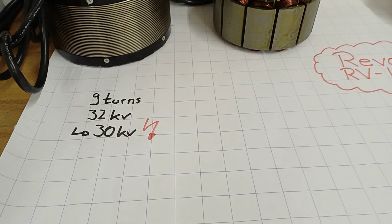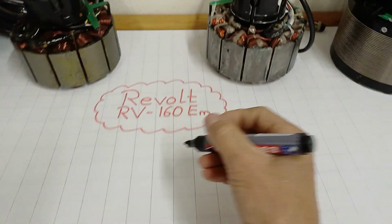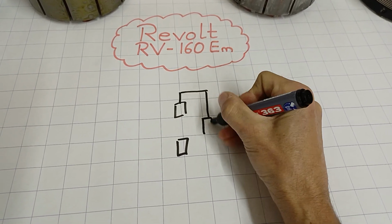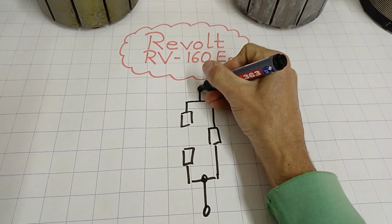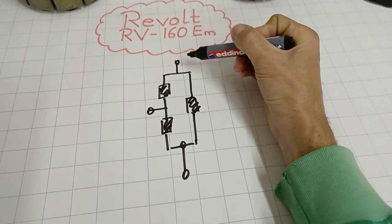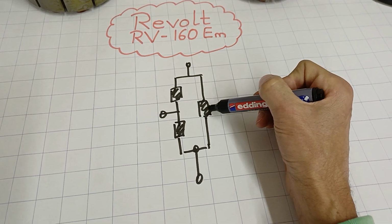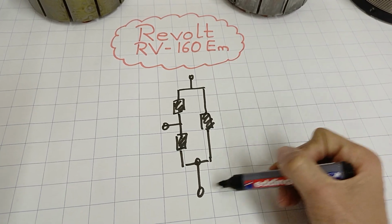If I talk about resistances, inductances and so on, I always refer to 2 outer terminals, and the third one is left open. Internally, we've got the 3 winding packages, which are connected as a delta. With 2 outer terminals and the third left open, 2 windings are connected in series and 1 is connected in parallel. So I am talking about the resistance between 2 phases.